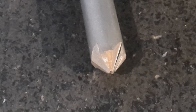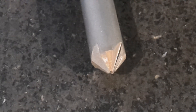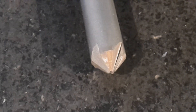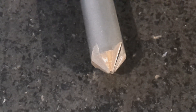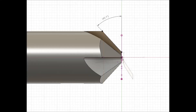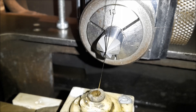So I want to try to recut the cutting edge with one clearance angle of about 20 degrees. As I can't set such a big clearance angle with the wire alone, I have to tilt the part about 10 degrees — so the clearance angle results from tilting the part and setting the wire to an angle. Tilting the part distorts the angle of the tool a little bit, so I've modeled the whole setup in Fusion and measured the error, so I can hopefully correct the G-code for cutting the angle. I've decided to tilt the part 20 degrees to get enough clearance on the cutting edge.